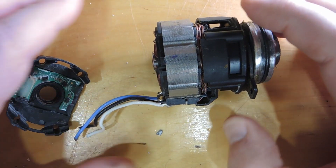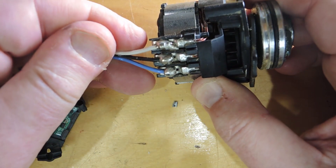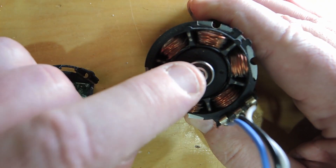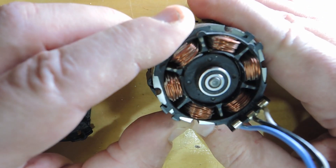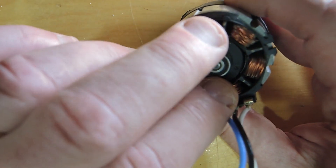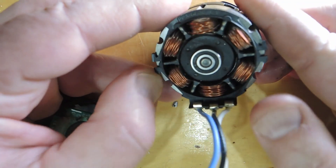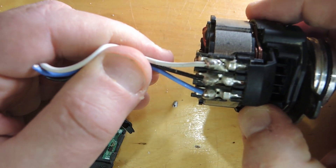This is the DC motor — it's a brushless unit. If you look on the side here, there are three wires because this is a three-phase motor. With a brushless design the stator has the coils and the magnet lives in the rotor, which is the reverse of what a brushed motor would be. Three wires, three phases. Current is applied on one of the phases, causing the coils to rotate the center a little bit, then the next phase is engaged, and the next, and around it goes. Obviously the job for a microprocessor.